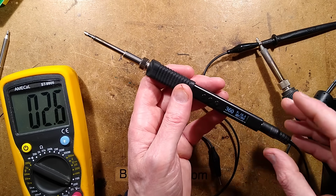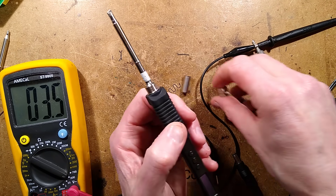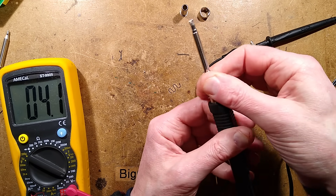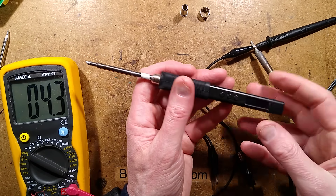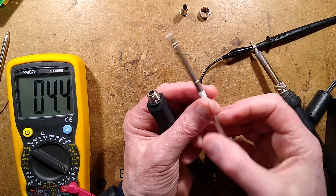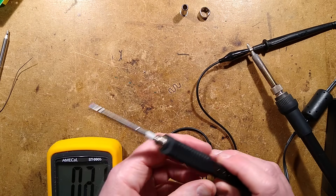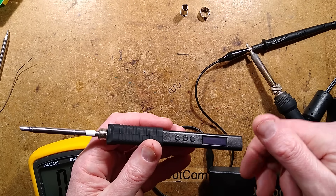With the grounded arrangement and the iron heating up, the meter is just displaying 1.3 volts — nothing major. Touching it to the barrel reads essentially zero. That would resolve the leakage issue. I did notice that when you put the bits in, you sometimes have to swivel them about a bit to make the connection because the connections inside aren't great. Mine was initially glitching — the display was flipping backwards and forwards between temperatures — but just swiveling and reseating it makes the connection properly. It may just be a metal incompatibility. It's cheap — just a fun thing that may suit those on a budget.